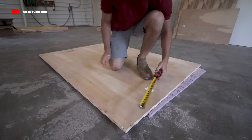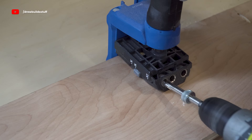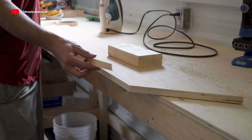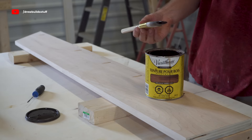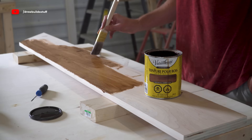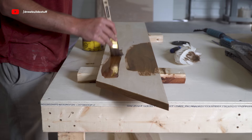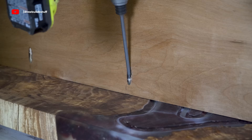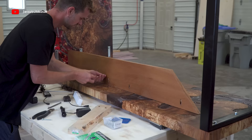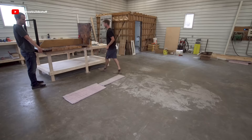The actual desk itself is pretty much done, but one last thing I'm doing is taking this scrap three-quarter-inch sheet of maple plywood, cutting a strip off, and putting a few pocket holes along it. I'm going to edge-band it with some maple edge banding, then after giving it a good sand up to 180-grit I stained it with a stain that makes it look somewhat similar in color to the elm inside the desk. Then I'm just going to use some pocket hole screws to screw this about six inches from the back edge of the desk, and I'm going to put some power bars back here — it's just going to be a hidden place to hide all of the cables for the desk and the computer. And that's this build complete — I'm surprised it's still in working order.